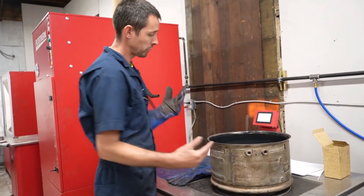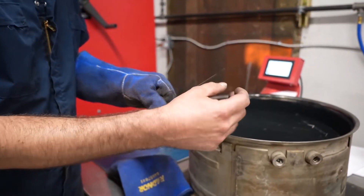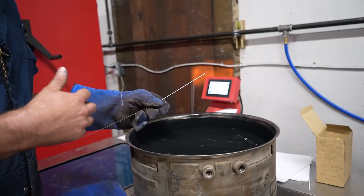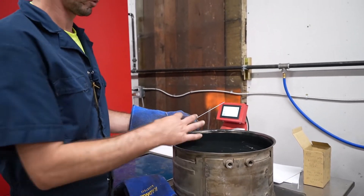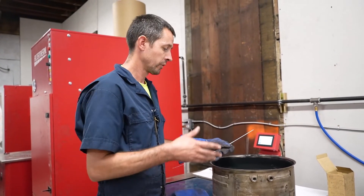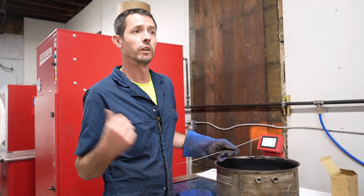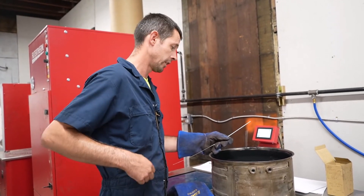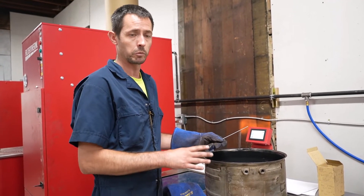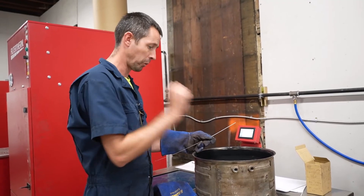It actually takes a large amount of heat to break this bond. Sometimes when we pull these filters out of the oven, there'll be little rods maybe an inch long just coming out of the holes like confetti - that's from that heat breaking things down. You need to get over around 920 degrees to actually start breaking this stuff down. A pressure washer at 230-240 degrees is not going to break this down. You need almost a thousand degrees or more - our oven goes up to 1,100 degrees, and with different filters can go even higher. That heat is the key to cleaning. You're never going to get that with a pressure washer, and the holes are so small you're not going to get full pressure down every single hole anyway.